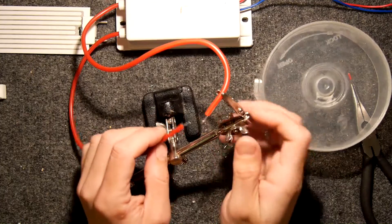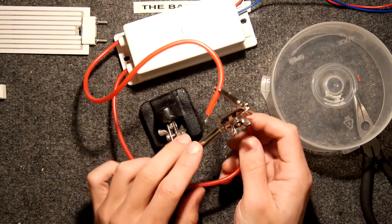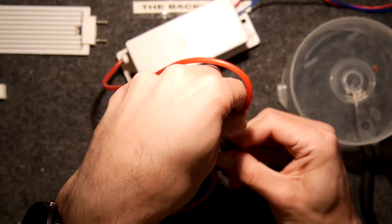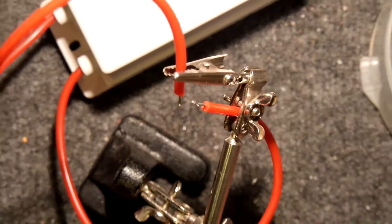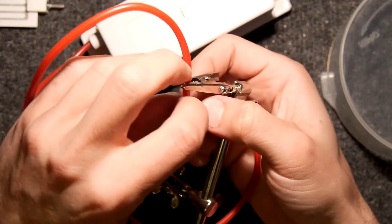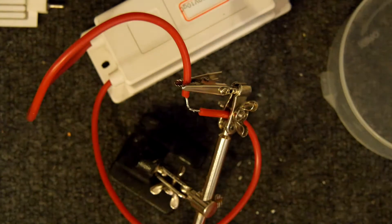Right, so have a look here. I've got the first high tension wire in this grippy thing and I've lost the other one, which is kind of annoying. I'm going to see if I can just pinch it — it's nicely pinched here. So we're going to try to get a nice gap between these two things. I'm going to switch to manual focus because we'll need some control over this when we're playing with it. I'm going to try to get them within a millimeter or so of each other — that's about a millimeter. Let's turn the lights off and plug it in. Just going to check it's definitely not touching. Ready.